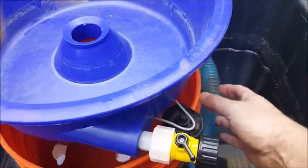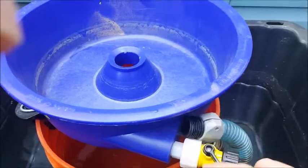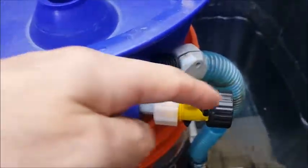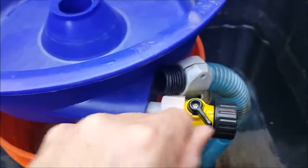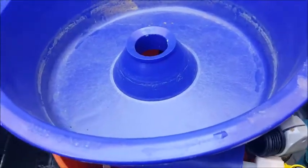So now I'm going to hook up my pump here. One thing I wanted to mention: notice the valve here is turned about halfway on. It's fully on and open this way, and fully closed turned all the way here. What this does is it prevents too much water from blowing in at once, because you don't want to potentially blow your gold out.